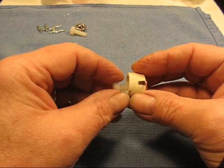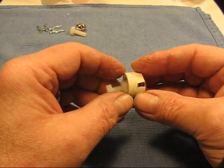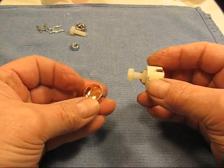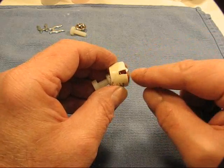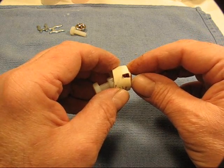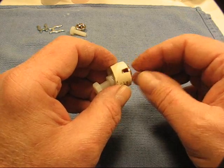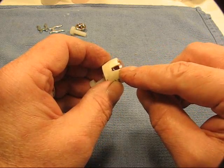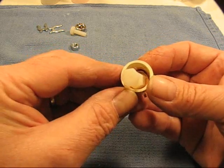I've taken some parts laying around the house to make this up. I took a half-inch copper fitting end cap and cut it into two pieces. I made one piece fit in the end of this half-inch PVC coupling. I notched the copper cap and I notched the coupling.